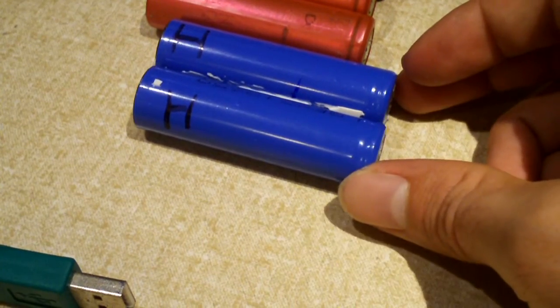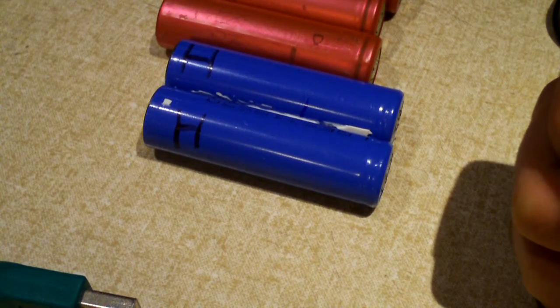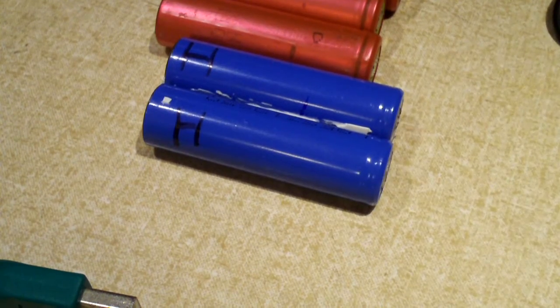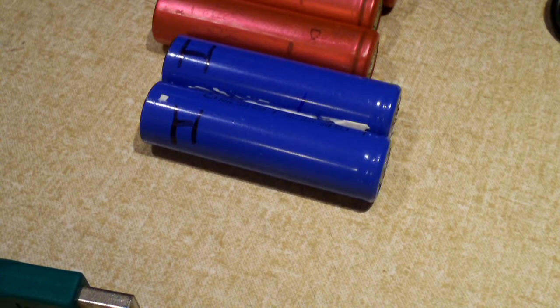You may be more used to charging nickel metal hydride cells, like rechargeable double A's. You may know it's pretty normal for them to actually get hot. But for lithium ion cells like this — no. It's okay if they get warm; that's to be expected. But if they get so hot to where they feel almost too hot to touch, then you're actually in a pretty dangerous situation.